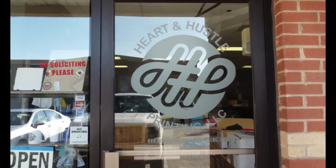All right, so let's look at this as a single head, the MT1501. When it comes to doing embroidery on a cap, whenever you put it on here and you do your whole little thing and you put it in here, if the cap is to the left or to the right of your presser foot that you're going to do your trace off of, you can always use your arrows on the touchpad or the keypad to center it exactly where you need it. And once you have it, you can start to embroider. The thing about the 6-head is all of this runs on the same frame, right? So whenever you go to adjust one cap, it's going to adjust all of them at the same time.